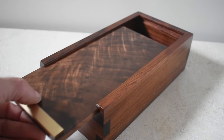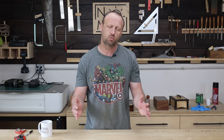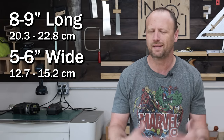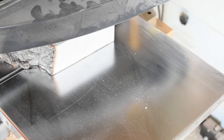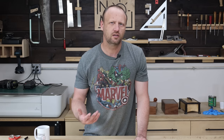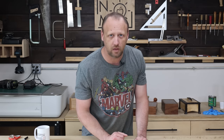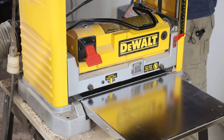Most of my boxes don't perform a particular function, so I go off of aesthetics and just what looks pretty to me. I end up gravitating towards boxes that are about 8 to 9 inches long, and anywhere between 5 to 6 inches wide. As far as the height goes, usually 3 to 4 inches. When calculating those dimensions, you also have to consider what's going to be the thickness of your material. It depends on what tools you have and what your skill level is. If you don't have any sort of milling tools, then you're probably going to be stuck with either using half-inch material, three-quarters material, whatever it is that you can buy at your local store. If you do have something like a planer, well, then the sky's the limit.